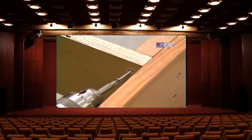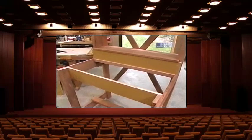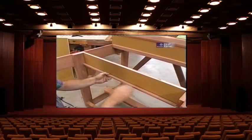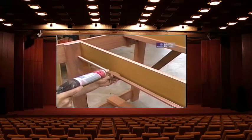Well, this 5.5-inch piece of 3/4-inch MDO is the back of the tool area. And it also provides some support for the work surface. Okay, now that takes care of the cleat that'll support the back edge of the work surface. Now here at this piece of MDO board, I'm going to put some little cleats to support the bottom of the tool shelf. I'm going to fasten it in place with some construction adhesive and some 1.25-inch finish nails.